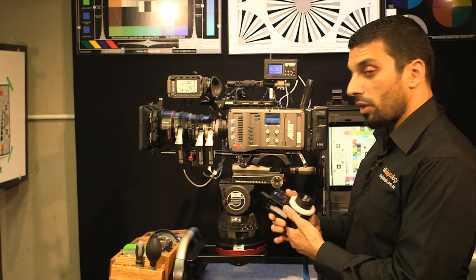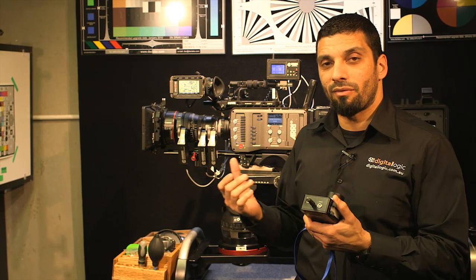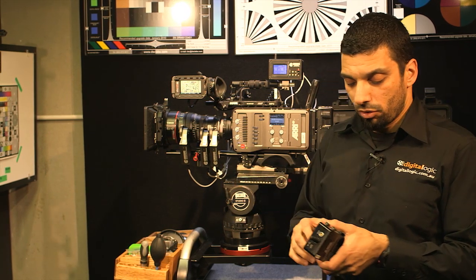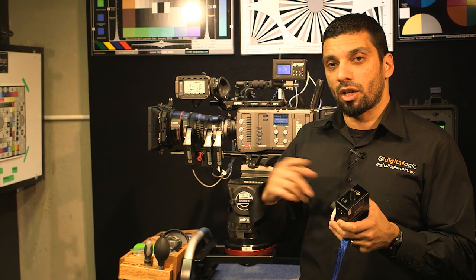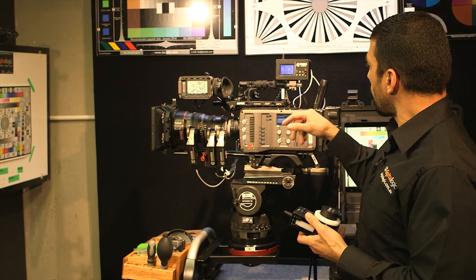The first thing we did with the digital system — you can automatically set the start and stop limits without having to manually set the limits of the lens. Traditionally in analog systems you had to manually set the min and max positions of the range you're covering. With this sort of system it's all automatic.